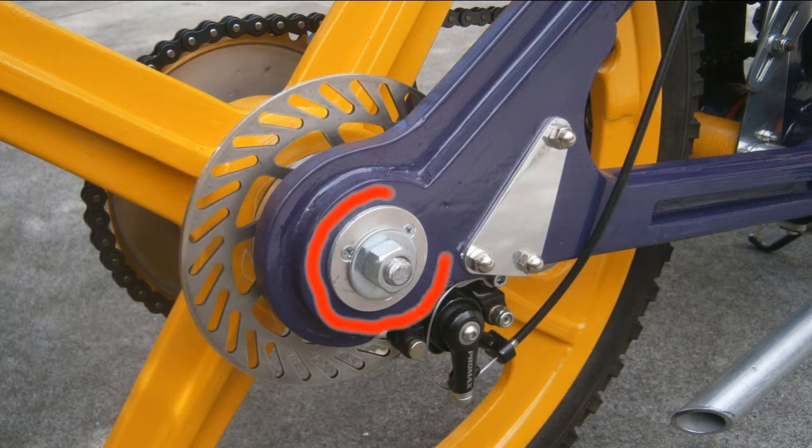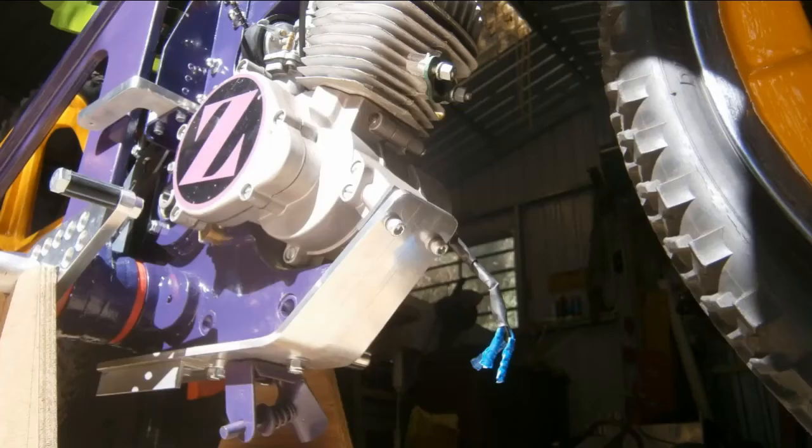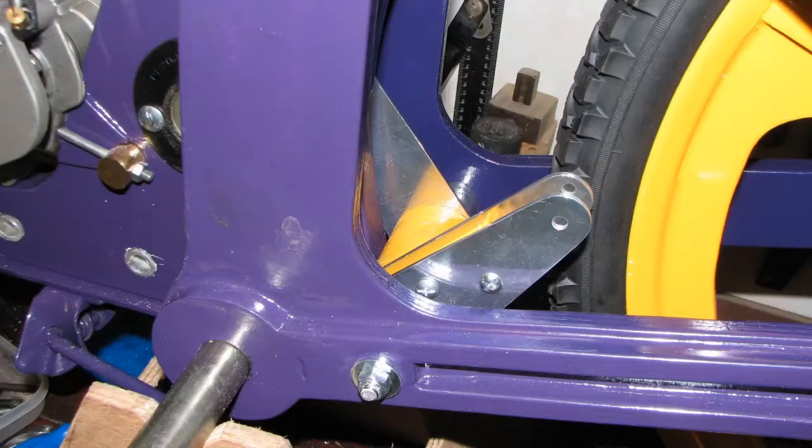These permanently attached aluminium discs spread the load to prevent the plywood from being crushed when tightening the rear wheel axle. Threaded thick wall aluminium tube provides the anchor points for the cantilevered front engine mounting. A round bush through the mainframe provides the anchor point for the rear engine mounting. The only reason it is brass is because that's what I had in the scrap metal bin.